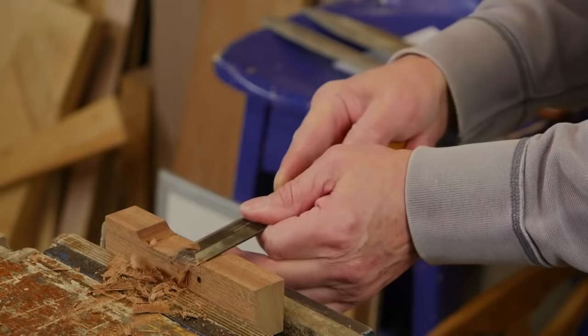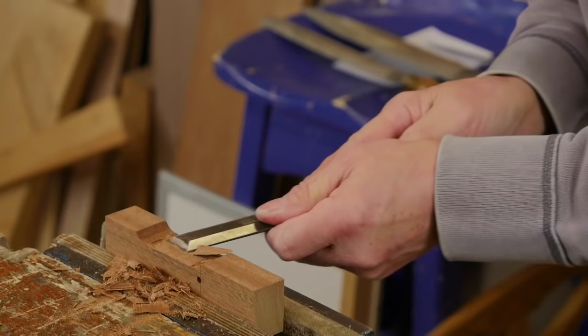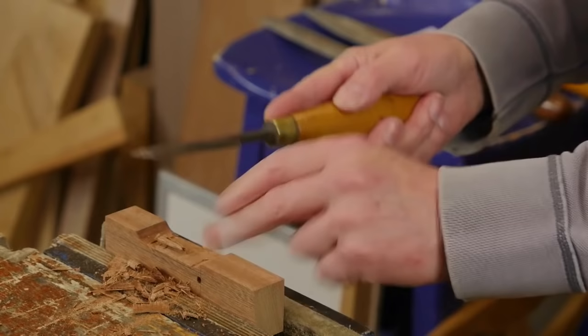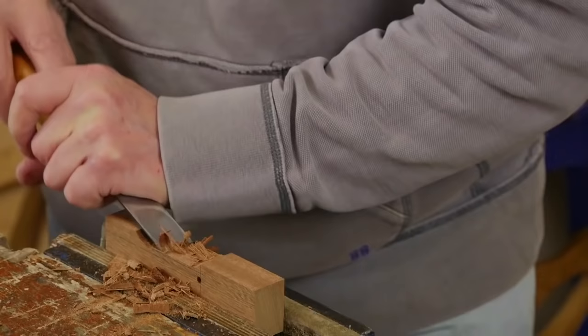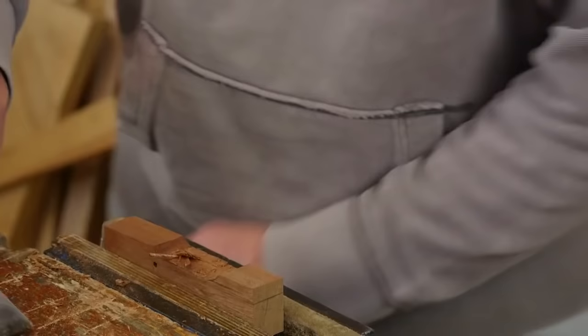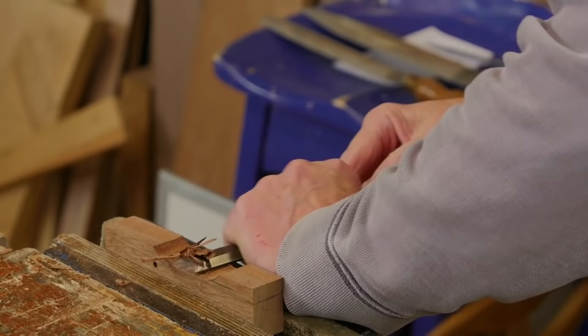But of course we're craftsmen and women and we're looking for quality in our work. So I would probably pare this down until it's acceptably smooth and level. Just tease those fibres down the corner of your chisel. Feather into it here. It's a bit rugged right now, but it's going to be fine. So I only have 1/8 of an inch between here and a cut line that I'm going to put in here in a minute that I'm going to use the saw for.